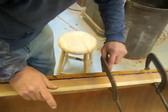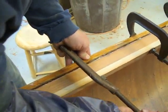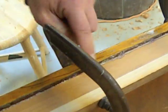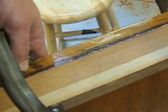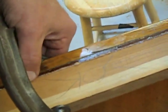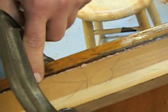This has to be exactly the way you want it. That well's a hair high there. My goal right now is to put this on so that the hull is up just enough that when I belt sand this, after it's all cured, I'm taking the varnish off the hull and I'm not really removing any hull. Which is about, I don't know, say a manila folder paper thickness.